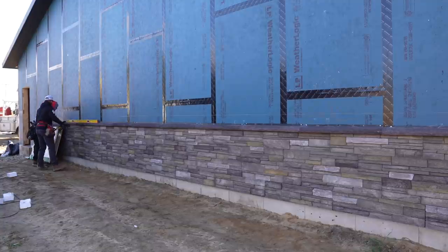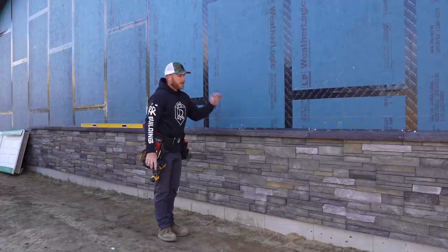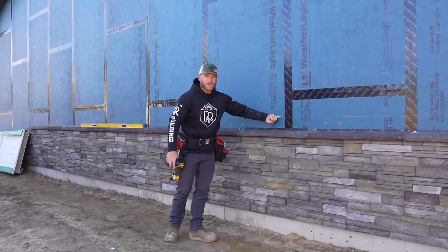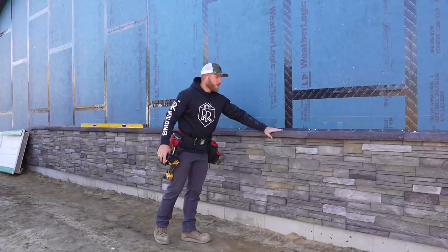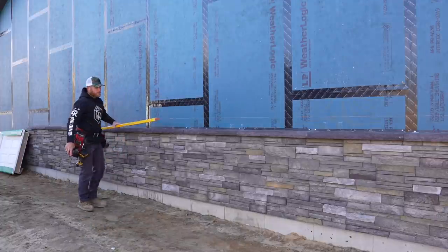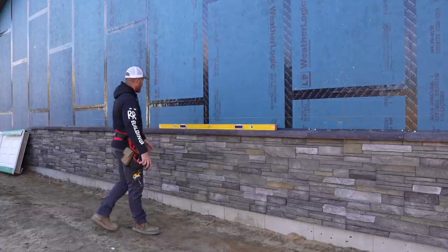That's pretty dang good. Cool, so that's as easy as this stuff is. That just took Greg and I like 10 minutes. It's important to note, though, that we did spend considerable time, as we did every row, making sure that we were always consistent on our reference line that we made off of our base trim at the very beginning. That allows us to come through, put these capstones on with relative ease, and with pretty good, quote unquote, perfection, with the 76 inch, 78 inch Stabila here, consistently running nice and level.